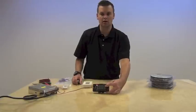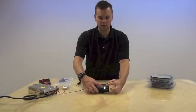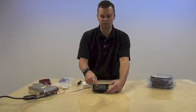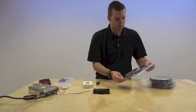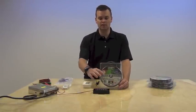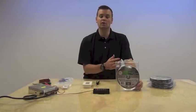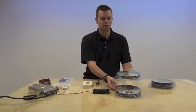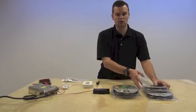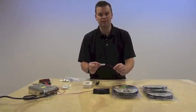When you turn it off you'll see none of the lights on this side are operating. Whenever power is going to your lights, no matter what mode button you push, you'll have some activity on this side. When there are no lights on this side that means the power button is off. When hooking up your LED lights on large installations, you're going to need to amplify the signal and power on long runs. On shorter installations with just two reels of light you won't need anything other than what you see here. For installations beyond that, where you're adding additional reels of light, you're going to need to pick up an RGB amplifier from our connectors and accessories page.